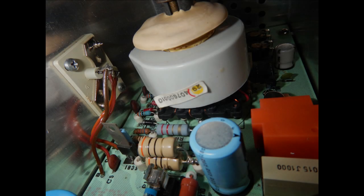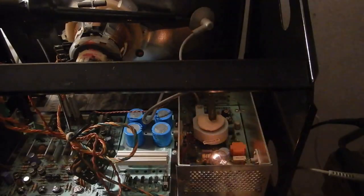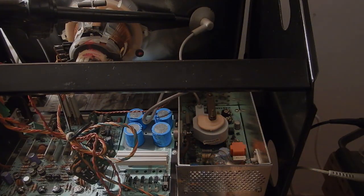During the first visual inspection on the other chassis, I've noticed that the winding assembly of the flyback transformer was detached from the epoxy that secured it to the ferrite core and was free to slide up and down. So first I applied some glue to attach it again to the original epoxy blob. I've then repeated all the semiconductor checks and all the previous steps already done for the other chassis up to the first power on with the series light bulb. Wow, this was much brighter than the other one.